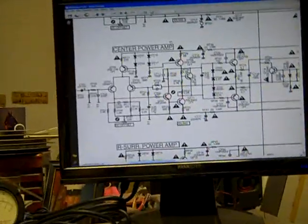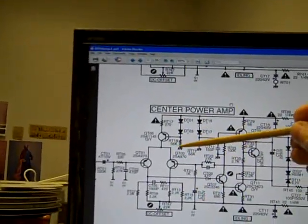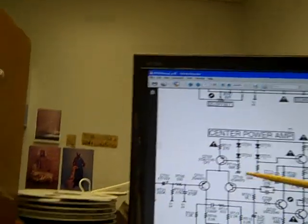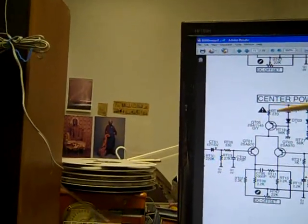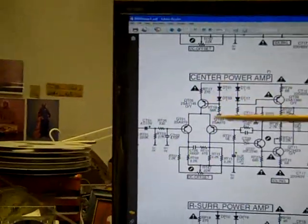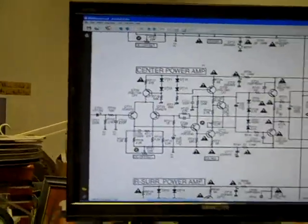The problem turned out to be that this 56K resistor was bad. I determined that when I discovered there was no voltage drop across RT17, even though the base-emitter voltage was nearly correct. Replaced the bad 56K resistor and resolved the problem.